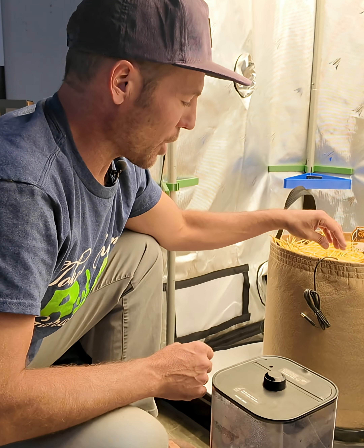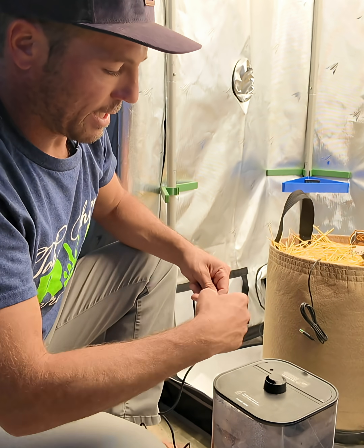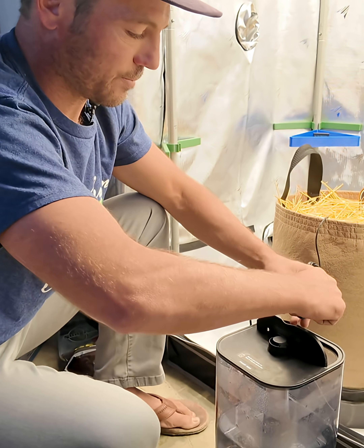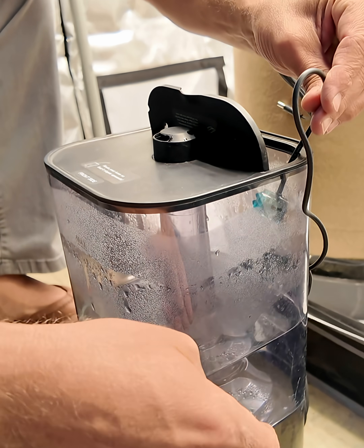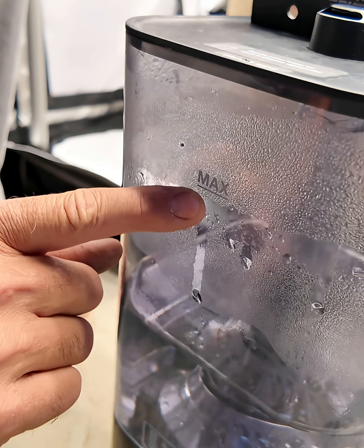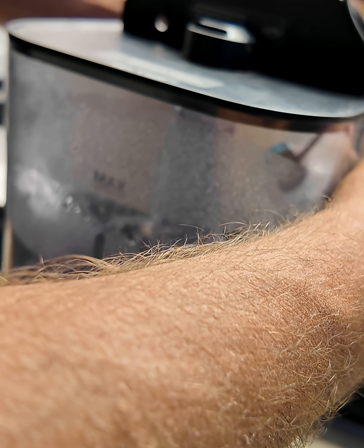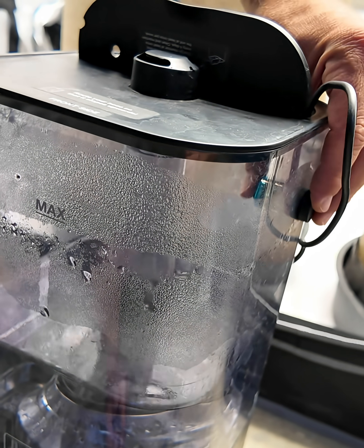This laser is going to go in over the top. If you don't have a hole, I'll show you from this side — you just dangle it in, right to where it says max water line. Can you see right here? It says maximum. That's about where I want it, so I'll put the laser at about that height and then you can adjust it.